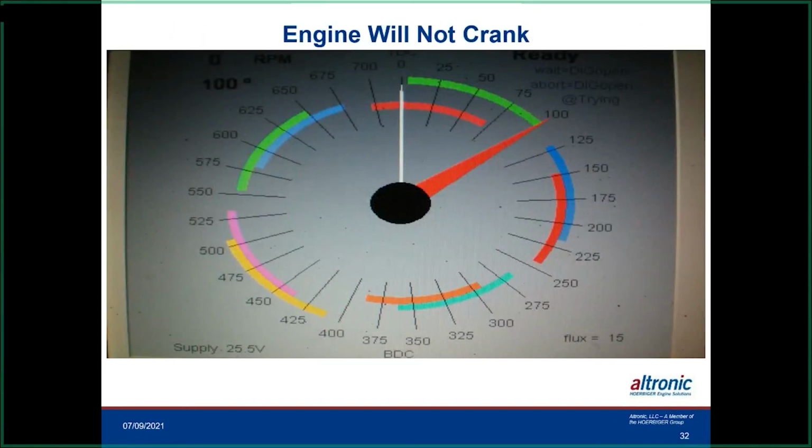This is a case where, if it was a mechanical engine, you see our red arrow here. This is the first cylinder it's going to start injecting air at. As you can see, this big area here, there is no place to inject air. So in this case, the engine will not crank, because number 1 cylinder just got done, so this part has shut off, and there's nothing to jump in here. If it was a mechanical system, there's nothing you could do but actually bar the engine over a little bit until you got cylinder number 2, and then it could start injecting air again. Then number 3 would pick it up, and so on, to get the engine rolling. This happens a lot with a mechanical system.